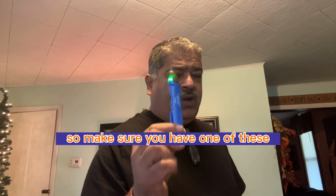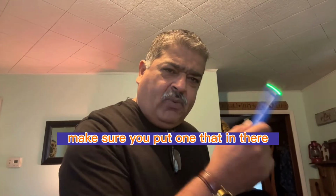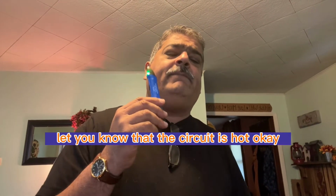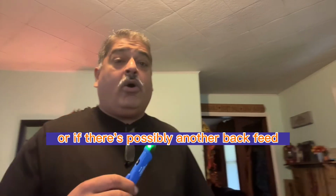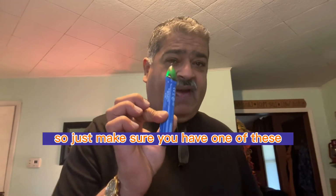So make sure you have one of these, so that way you can detect before you even put your fingers in there. Make sure you put that in there, and it'll start beeping relentlessly, letting you know that the circuit is hot, okay? Or if there's possibly another backfeed from somewhere else. So just make sure you have one of these.